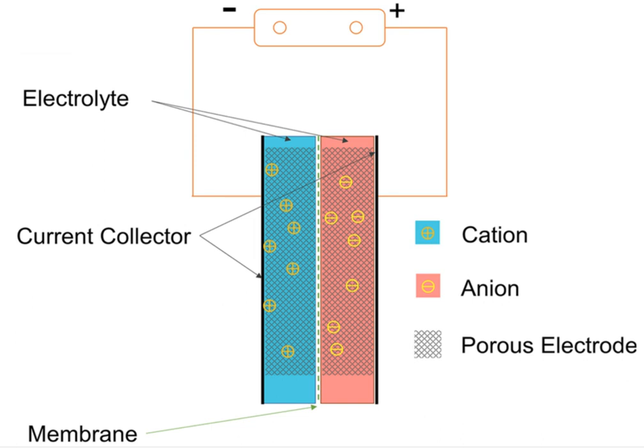The time T a supercapacitor can deliver a constant current I can be calculated as T = C(U_charge − U_min)/I, as the capacitor voltage decreases from U_charge down to U_min. If the application needs a constant power P for a certain time T, this can be calculated as T = C(U_charge² − U_min²)/(2P), wherein also the capacitor voltage decreases from U_charge down to U_min.